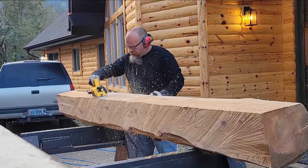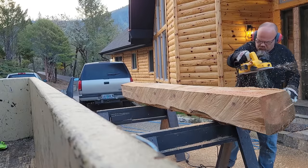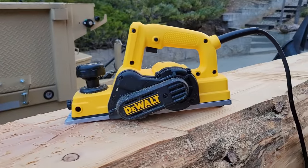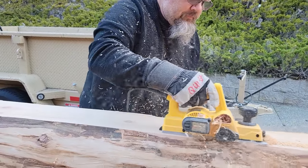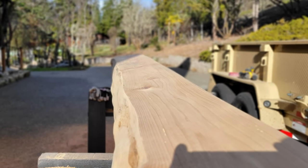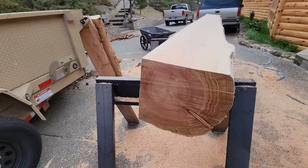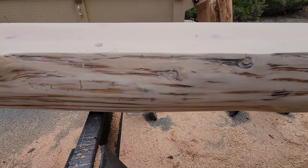This made short work of removing all of my chainsaw marks. I only needed to do this to the top because my rocks were gonna overlap and hide the back anyway. So I just needed to do a really good job planing this, and then I sanded it up to 220 grit. I also used my 50 grit metal sanding disc on the front to remove that cambium layer and squared off the edges of this tree.